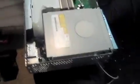and here's my wire. Now I burned out one of the LEDs over here because I've got to put a resistor on it, and I tested it and it burned it out right away. So I just replaced the LED over here, since you're not really going to see any LEDs over here. So I angled this one upwards and left that one there. I'm just going to leave two over here on this side. But I already soldered the resistor onto this LED. That one's ready to go. And I'm waiting for the hot glue to dry for this one. And I'm going to solder the last resistor onto there and complete everything.